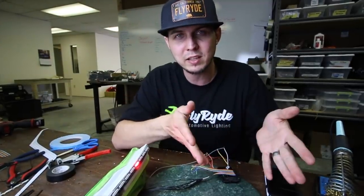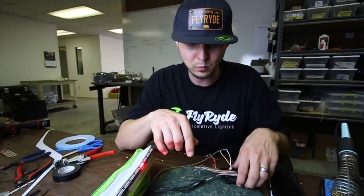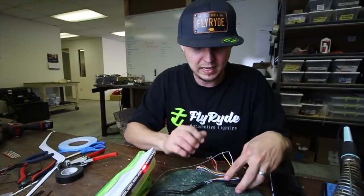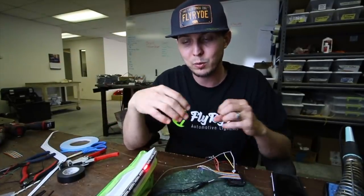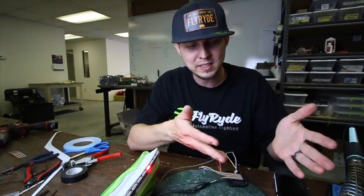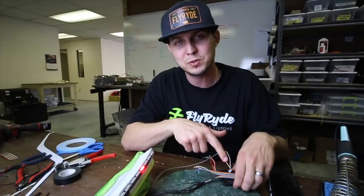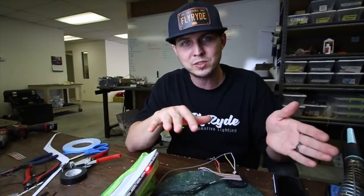The reason for that is when this was connected to a different set of GTR lights over there, it blew a channel because of something inside the LEDs on that circuit board. When it did that, it ruined the ability for that little channel's ground-throwing function. It killed it — so it just automatically throws out ground no matter what, meaning there's no way to turn that LED off unless I take the wire it's hooked up to and move it to a different wire on the ghost sequencer. If that's wire three, I move it over to wire 15, then with programming I can tell the ghost module to make wire 15 take the place of wire three. I'm only using nine channels and I have 28 on the ghost unit, so reprogramming is fast and easy.